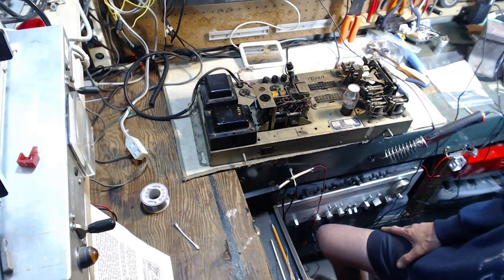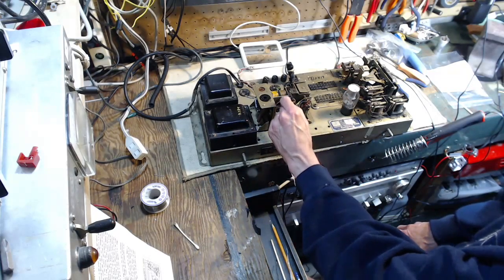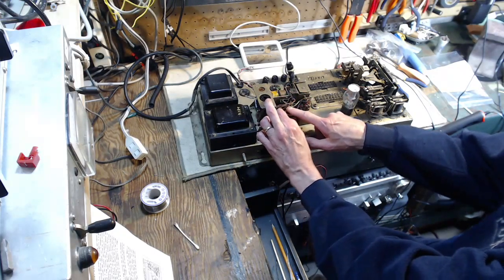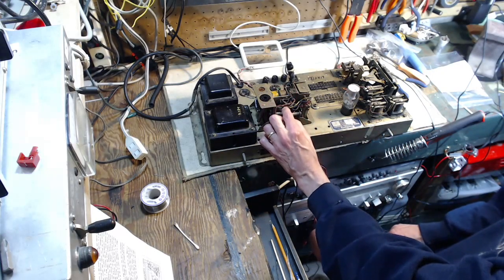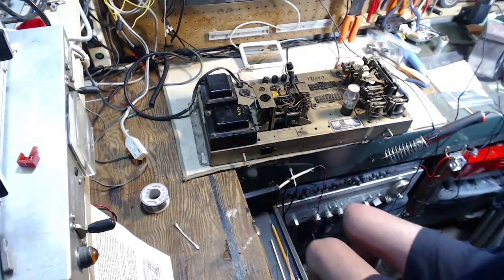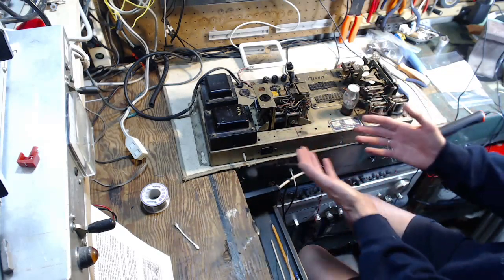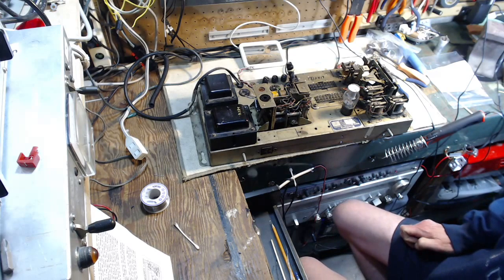Should take place here. The wire I've installed is right here. It's above the rest. And I get it like that, so it's kind of out in the open. So if it does start burning, it doesn't do damage. I'm staring right at it too. I'll put this in with one light bulb. One 40-watt light bulb in series with this isn't a huge restriction, because this is not drawing a lot of power as it's sitting here anyway. So it's pretty much going to get full supply voltage.